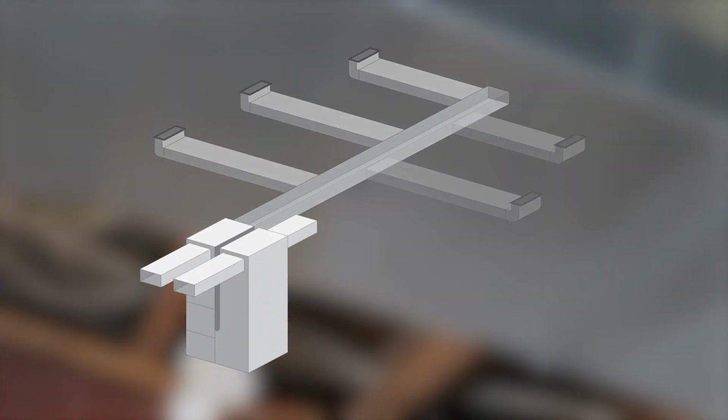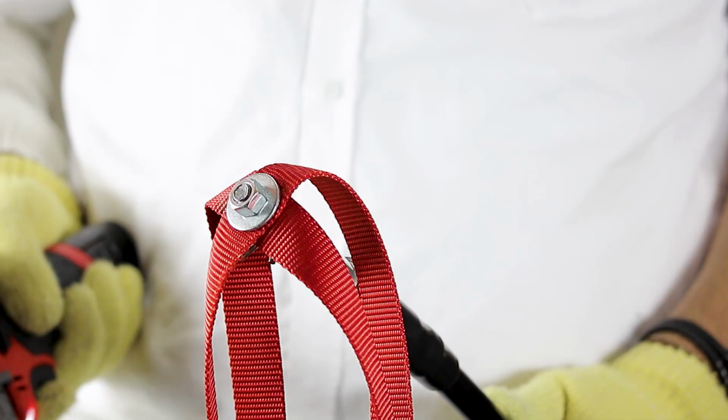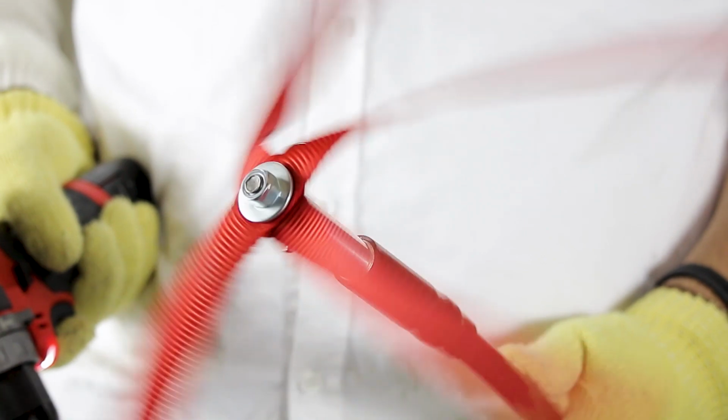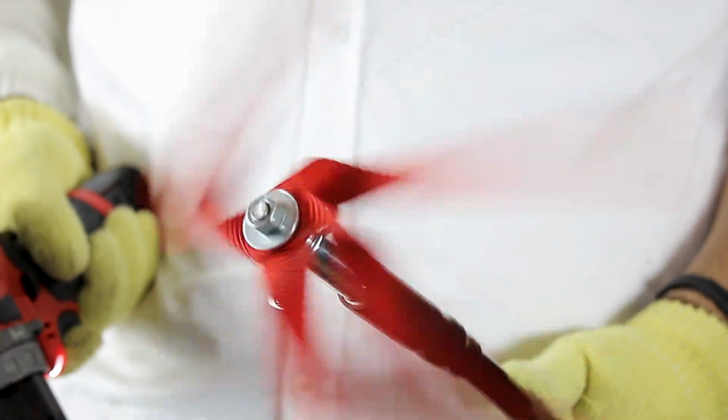Here's an example of the sequence of steps that would be used to clean a 30-foot section of ductwork. The DUCT-PRO Power Whip performs best when driven with a quality 3/8 or 1/2 inch drill with a clutch. The speed of rotation should be close to but not exceed 2,500 RPM.